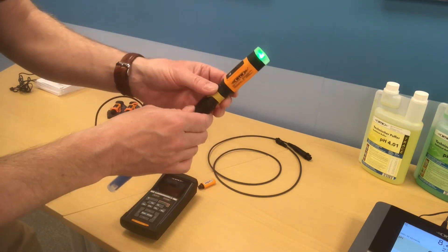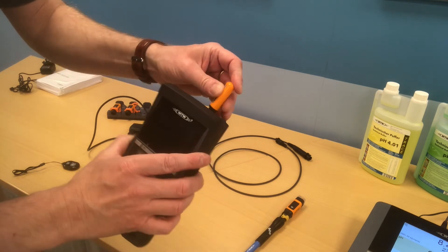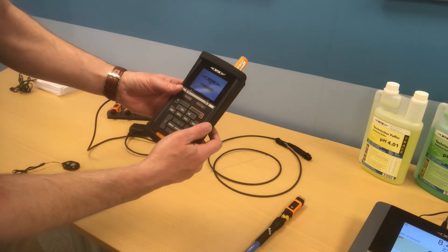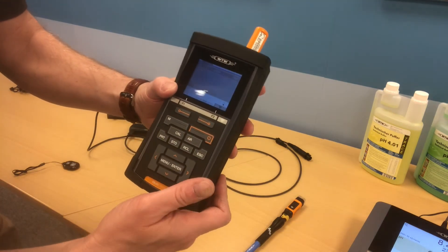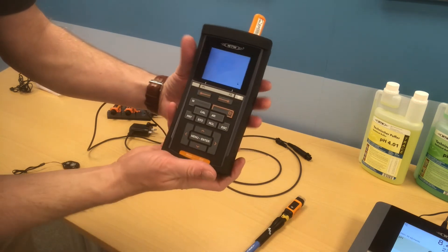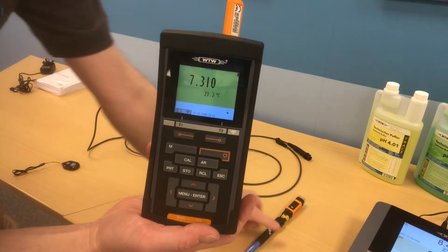That connection is now waterproof if it drops in the water or gets splashed. You can see it's flashing green — it's now trying to connect to the receiving device. Plug this into the back of the meter — any of the ports in the back if you have more than one. This receiving device can receive signal from up to three sending devices. It's now searching for a device — it's come up with one. Same as pairing your phone in the car, you just press enter, up arrow, enter, and then escape. It's now looking for the electrode remotely, and you can see it's come up with a reading. These are now paired.